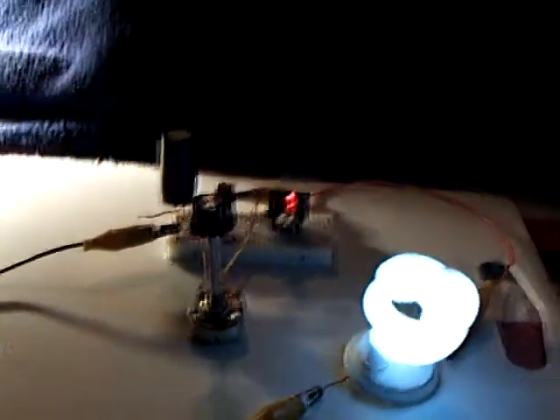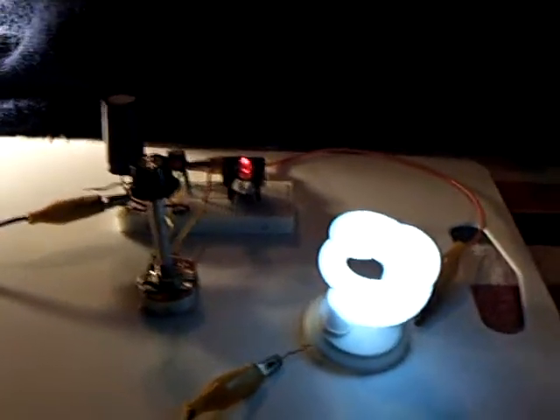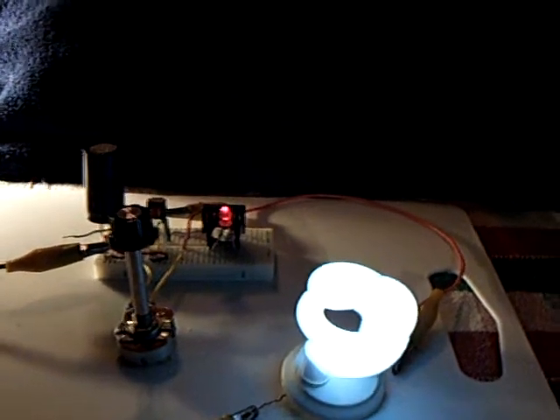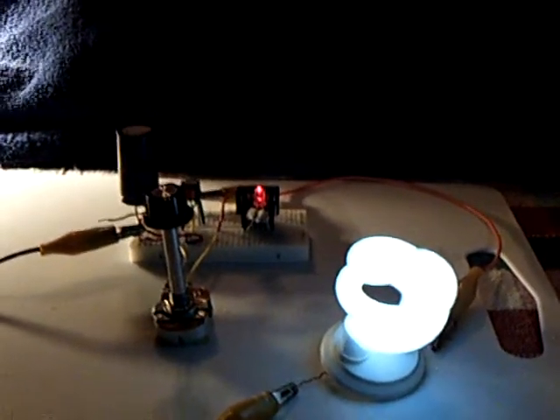It's running on two volts, two and a half volts. Let me pull the batteries off — there goes the batteries, and there's the unit running on the capacitor. It's really no mystery; it's just energy coming out of that capacitor. And it's not all that great — it's 30 to 100 milliamps, which is not that great.